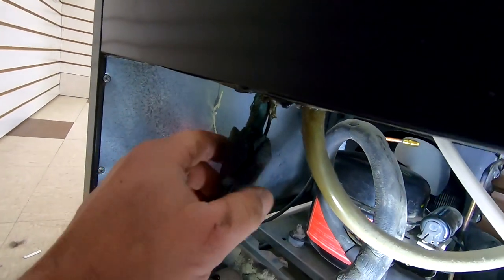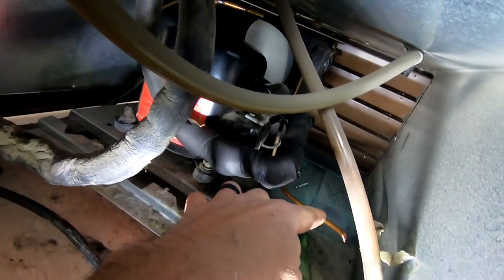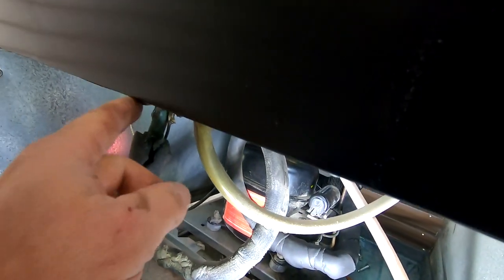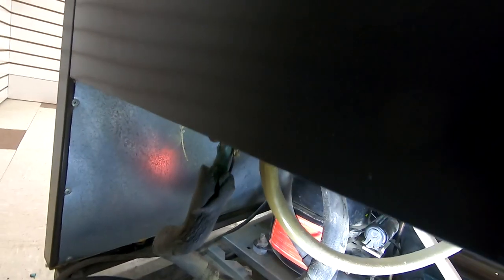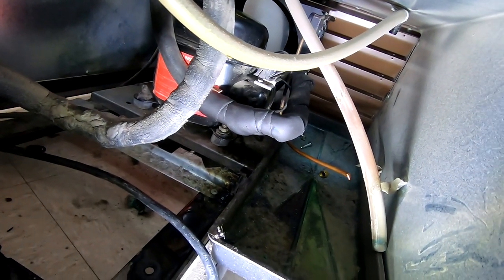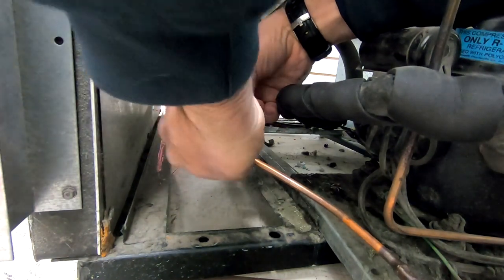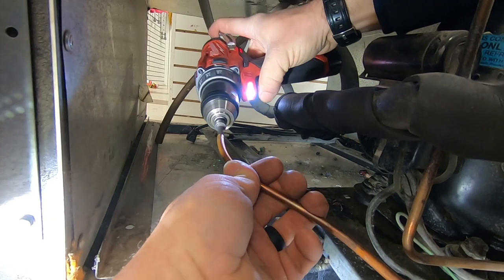Since this is 12 feet long, I'm not gonna tear all this insulation off — it's super hard and will make a mess. So we're gonna take it straight from the filter dryer, wrap it around, and then up. It'll conduct all the subcooling off the pipe. On the inside of the cooler it shouldn't sweat back there — we can always insulate it if we need to. Cutting out the other filter dryer that was in there; gonna swedge it so we can mount the filter going in.